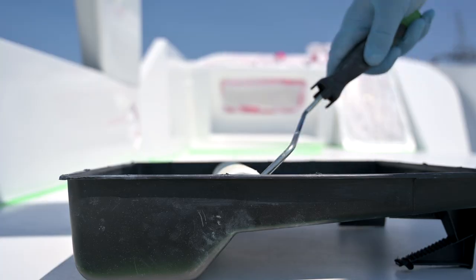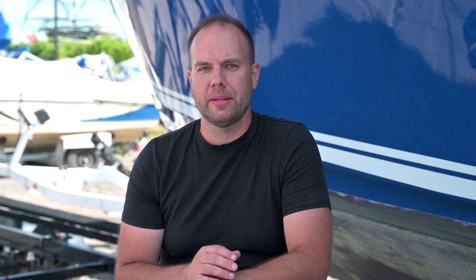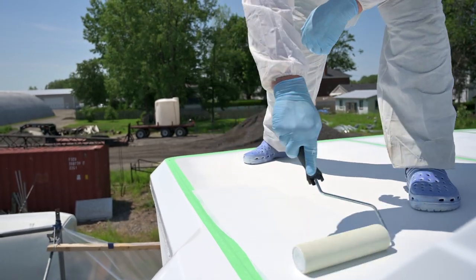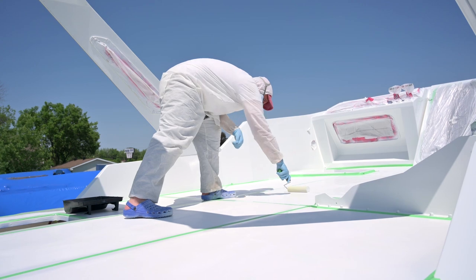The non-skid was really easy to apply. Buy yourself a little foam roller with very little foam — we got that at the local boat place. Go one direction, wait about 15 to 20 seconds until the paint gets just a little tacky, then go in the other direction. As you go the other direction the roller is tacky and it spreads the material really evenly all around. Wait about three or four hours to apply your second coat — that fresh paint you can walk on without leaving any marks.